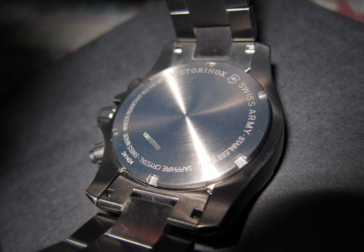Such a device shall be protected against inadvertent rotation or wrong manipulation. If it is a rotating bezel, it shall have a minute scale going up to 60 minutes; the markings indicating every 5 minutes shall be clearly indicated. The markings on the dial, if existing, shall be coordinated with those of the preselecting device and shall be clearly visible. The following items of the watch shall be legible at a distance of 25 cm in the dark: the time (the minute hand shall be clearly distinguishable from the hour hand); the set time of the time preselecting device; an indication that the watch is running, usually indicated by a running second hand with a luminous tip or tail; and, in the case of battery-powered watches, a battery end-of-life indication.